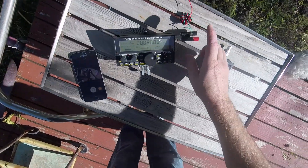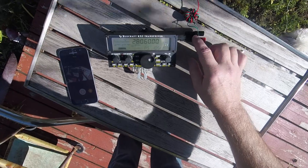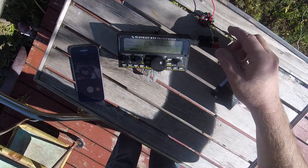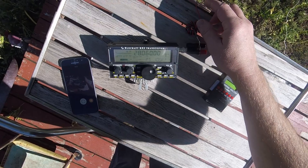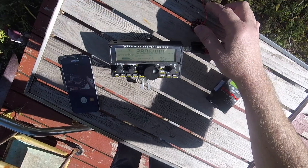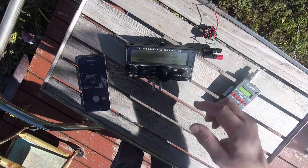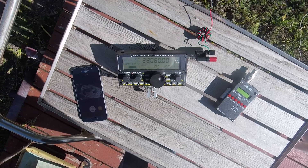So that's it. I'm going to take this 9-to-1, get rid of the binding post, and solder a BNC onto it, then wrap it up in some heat shrink or tape. On this end, I'm not sure what I'm going to do — I might just attach a 130-foot wire coiled up, then extend it when I get to where I'm going, as far out as I can.